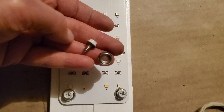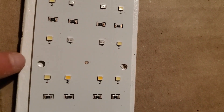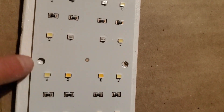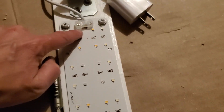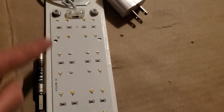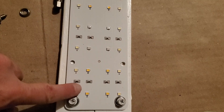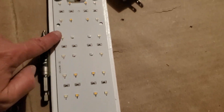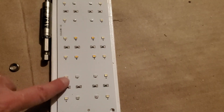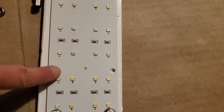These screws can be a little difficult to put in because you don't want to slip and hit one of the lights when you're drilling. It can tend to slip a little bit, and of course there are wires throughout. I've noticed sometimes when I'm done putting my screws in, the lights don't work properly. If that happens, just unscrew the screws — it helps to take them all out and then plug the light in. Usually it'll work fine, then just put the screws all back in gently. Don't over-torque anything because it could put tension on the board and cause the lights to mess up.